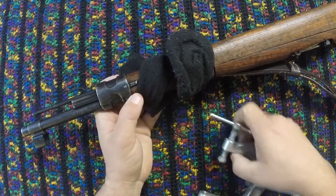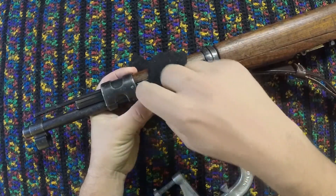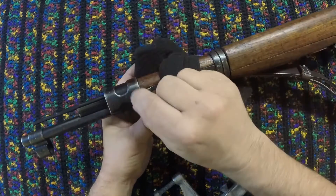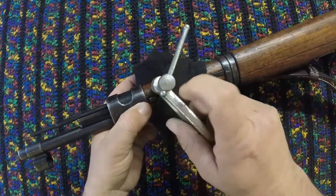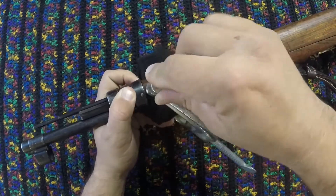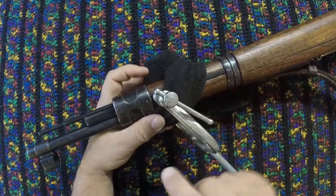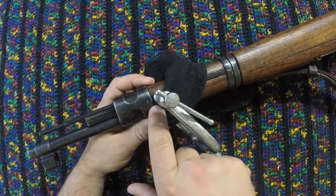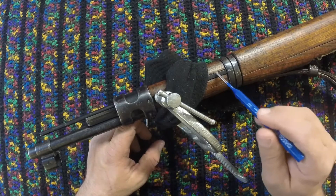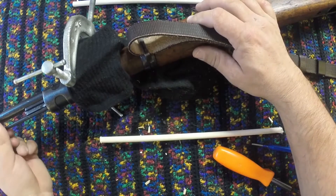Yes, I'm seriously doing this — we're going to take a C-clamp and put that on the bottom of the wood. This piece right here, you want to make sure is just over that. We don't want to put it into the wood — make sure your wood block and everything is not sitting underneath the cap right there. As we start bringing that down, we'll get to a point where we push that and we'll see that it has now pushed this piece down in there. That piece is down and we can also see a little bit of gap there between that spring and that.